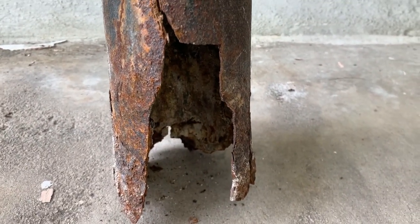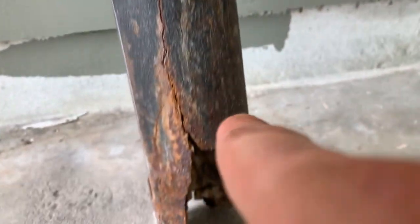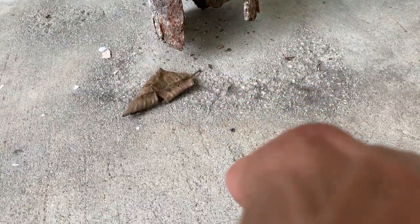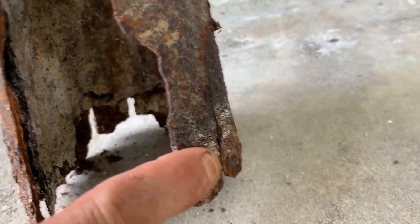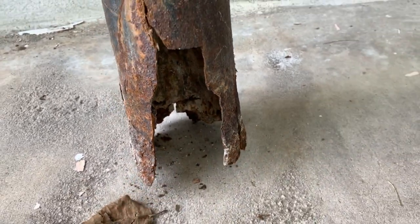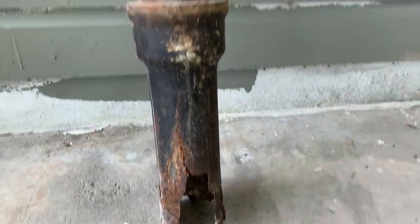When you open up the wall, everything that was coming in from the kitchen and the lavatory is coming down through here, just dumping out into the floor. So I had to open this up and it was broke all the way down in. I put my camera in there and discovered that the whole line was bad. This is like potato chip thin, really, really thin. And that's what the pipe underneath the house looks like. So there is no saving, and now's the time to take it out while we got the floor open.